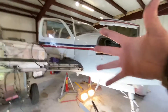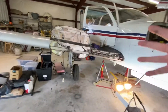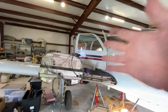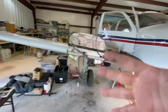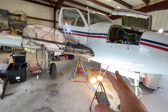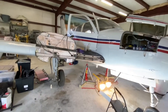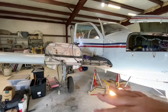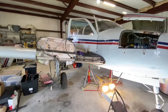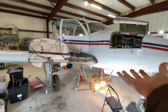A lot of what I'm finding is that little hardware stuff has hit its service limits. The rule of thumb on this airplane — and pretty much all at a commercial level — is everything is at a thousand hours. Whether it's the seals on the door around the window, everything's a thousand hours. Some is 500, some is 1,500, some is 2,000 hours, but rule of thumb you can go all the way around the airplane and everything has at least a thousand-hour TBO — time until it's done and has served its time.